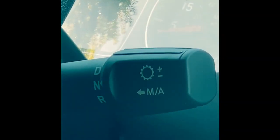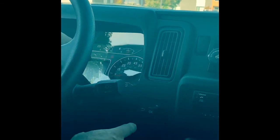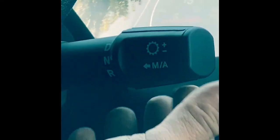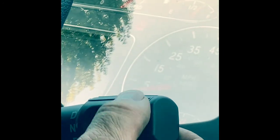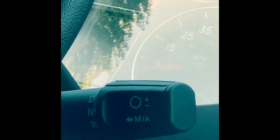A couple other things about cab features. This little joystick here is for cycling through the different features you can read on the LCD screen on the gauge cluster — it's more informative than anything else. This is our actual shift here. It does not push up and down or forward or back — it's a stationary switch. You turn it to get to drive, or turn it down to get to reverse. If you want to manually shift it, you put it into drive and push in on it to get to first gear on your gauge cluster. You're going to have to sit in this seat and work with it to understand exactly how it works, but don't try and move it because it doesn't move.